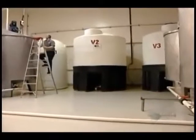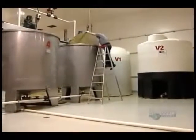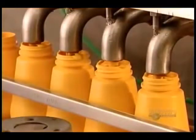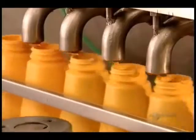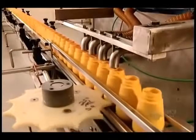Now the creamy smooth Dijon mustard goes into a stainless steel tank. A slow-speed revolving mixer removes the air, which would otherwise turn it brown and dull its flavor. The yellow mustard tanks also have mixers to remove air and to keep the condiment well blended. Both Dijon and yellow mustard have to cool overnight before bottling.